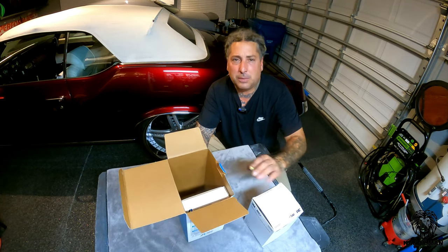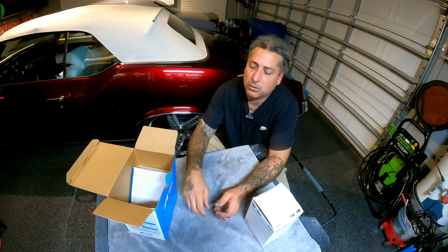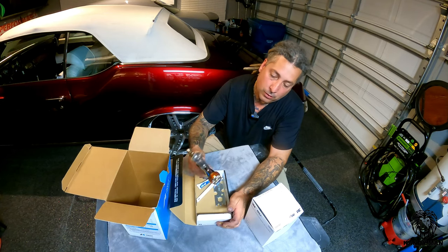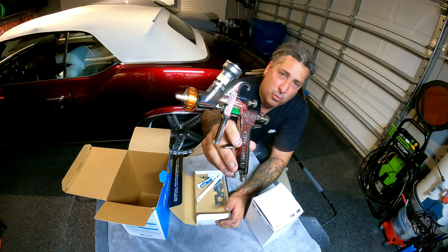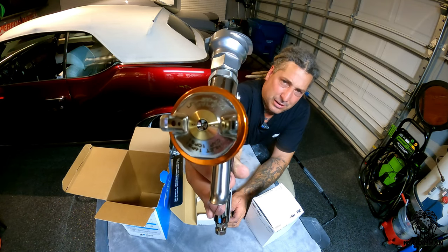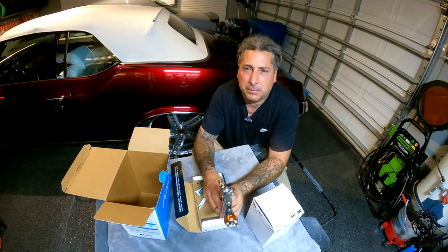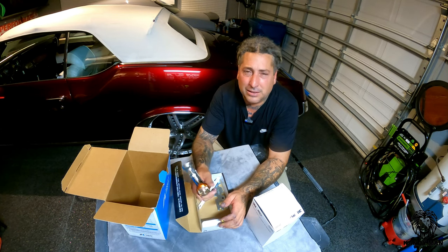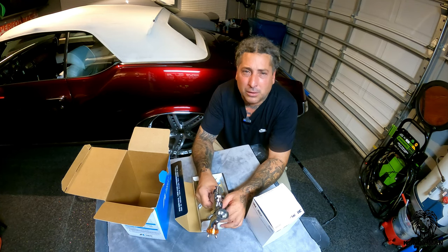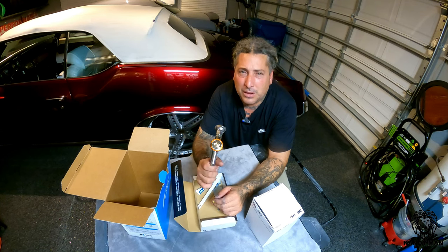If any of you guys may be new to painting, you've got everything you need other than a regulator to get rolling and get painting. Here it is — this is the LPH 400 with the LVX HVLP cap and this is the 1.4. It has the tulip head on it that most of the Iwatas do have. Definitely a really good gun — many many painters have this gun and it's been definitely tested in the business as a very stand-up gun.